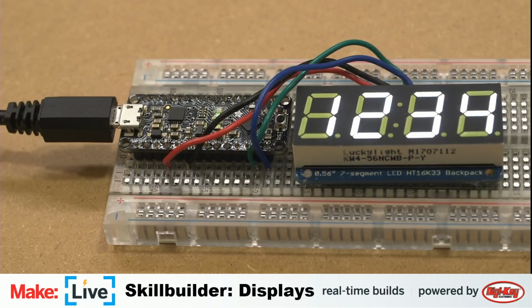So that's how I would go about it, depending on what your code is that is driving your clock, look for where it's actually dumping the clock value into the code, because it's eventually resolving somewhere, and then you should be able to do your if-then statement on that. So you can use that as a trigger to start your motor.